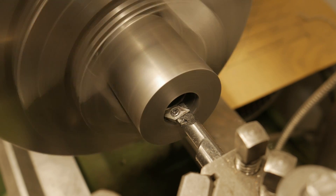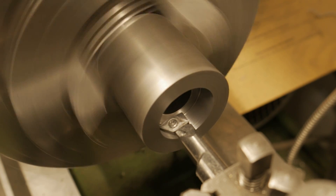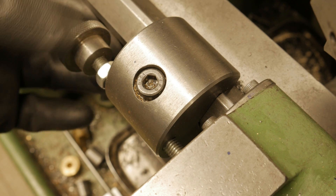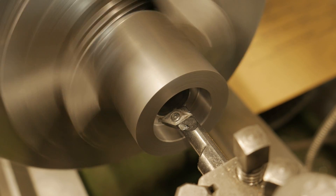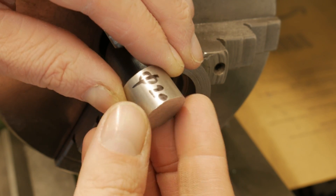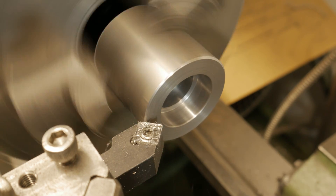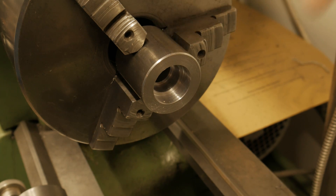The central support has two shoulders because one is used to insert the guide bushes. To measure the machine diameter I used a 20 mm bar to check where I was, and it was perfect. To be precise I took advantage of the bed stop, to be sure I didn't go beyond the bush's measurement. At that point only the internal bore remained, and the tool was perfect for this case, having a slightly smaller diameter — a good result considering the difficulty of making an internal bore like that.